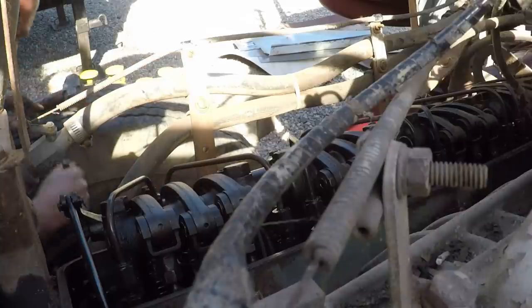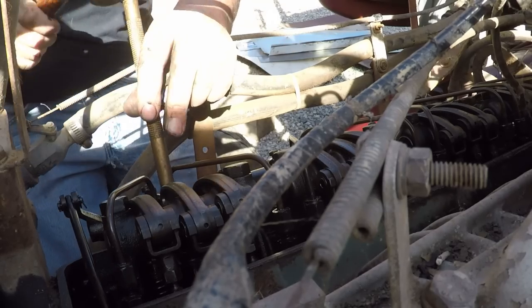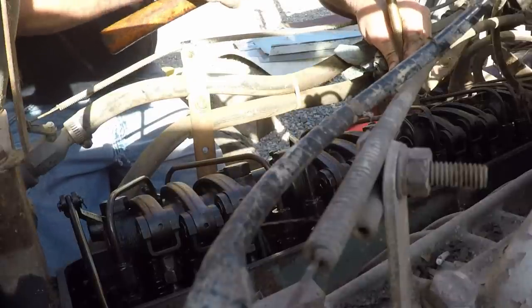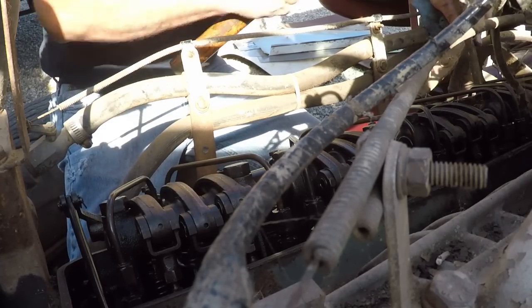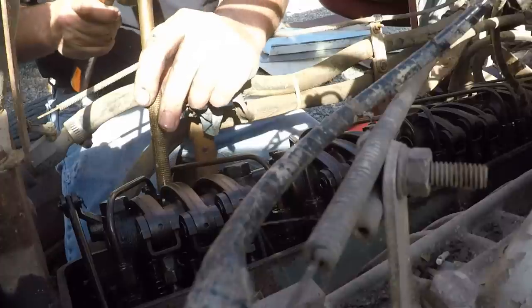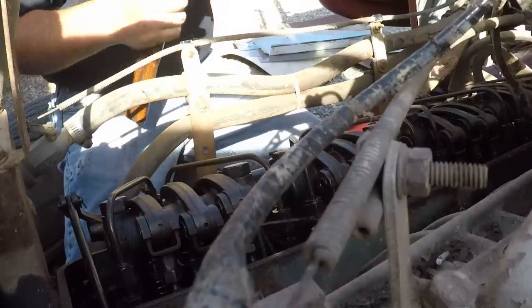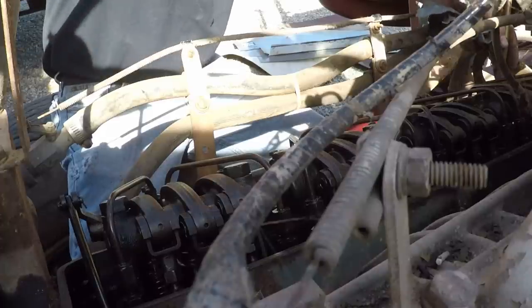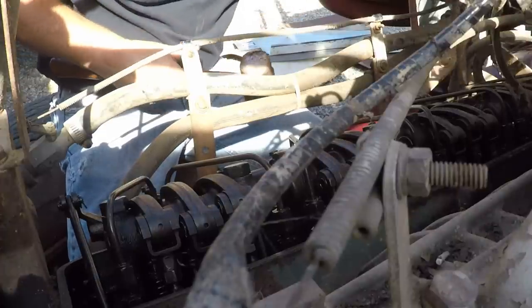So now what I'm doing, if you may have seen, is I took a brass punch, and I'm tapping on every injector, making sure they're free and not stuck. I'm also tapping on all the exhaust valves, making sure they will move freely in the head, because the last thing I want is to start it up and have one exhaust valve hang up and a dead cylinder that won't fire because it can't seal the chamber to create compression and combustion. So I go over all of this, and I look at the fuel lines, make sure you don't have any cracks or leaks or anything obvious going on, and I check all the rockers to make sure none of the adjusters have backed off. All in all, this motor is very clean. I went over all the top end stuff, and I was just amazed at how clean this was. So hopefully we got some good results and it turns out pretty good for us.